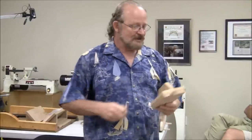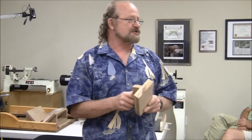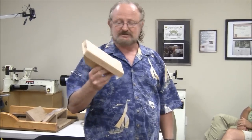And if you give me a hardwood shim, I can move something. If you give me a hardwood shim and a good size hammer, it's going to go where I want it to go. So it's pretty handy. I hardly ever buy door shims anymore, cedar shims. I always make my own shims because they're nice and uniform. I can make them as thick as I want, as long as I want. I get these made up in 2x4s and whatever, and like I said, you can knock shims out real quick, and they're uniform.